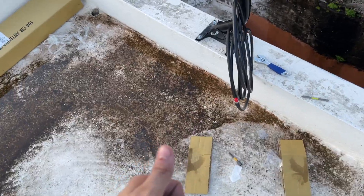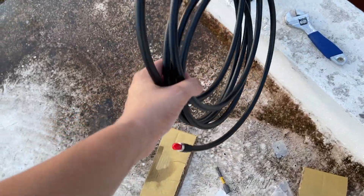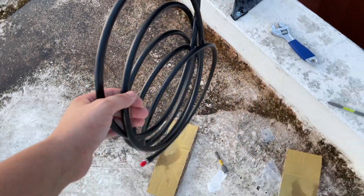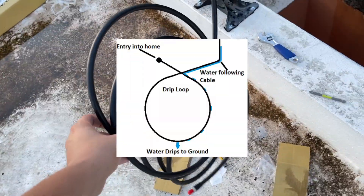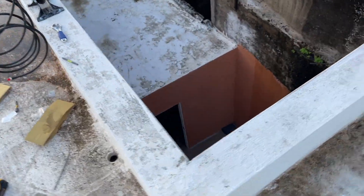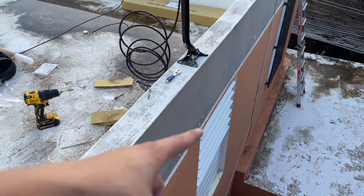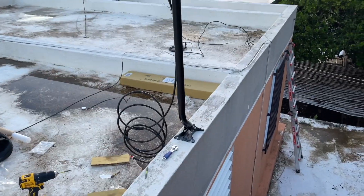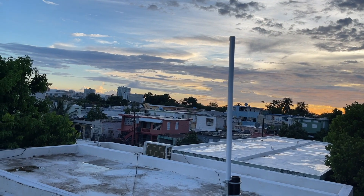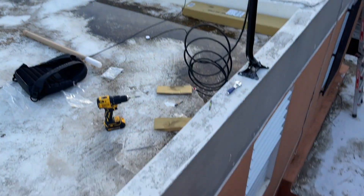One more thing — if you're going to do a hole through the wall or put the cable in your window, make sure to do a drip loop. I explain it a little bit in the other videos: it's like a circle so that if it rains, the water doesn't come in through the window. Boom, that's nice — we're going to have a lot of witnesses, I'm excited.